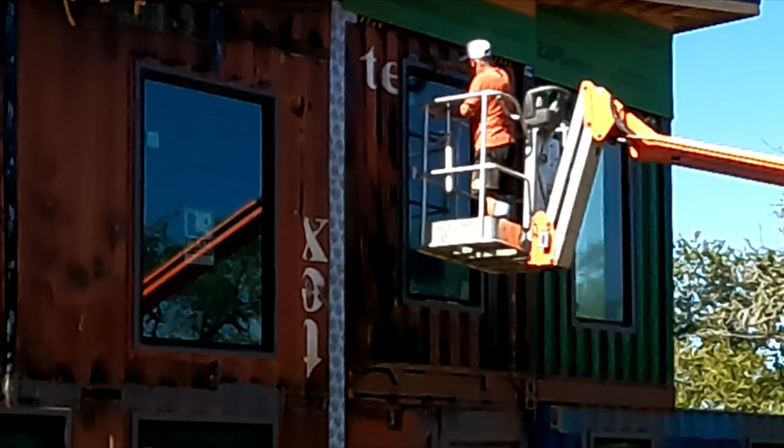Once I did that, I sometimes started taking the film off before that. I didn't mention that I cut the foam, if it was protruding through the frame, I cut the foam and cleaned the window off before I did the sealant. That was the thing I was doing before, that you might not have been very clear. But in any case, that's the first part to do, cut the foam out, so you have a very good solid area to put the sealant into.